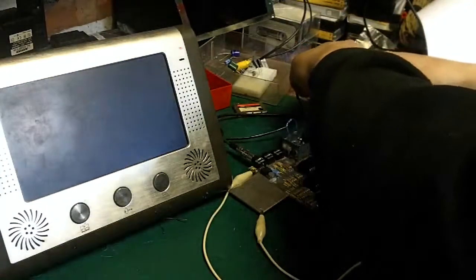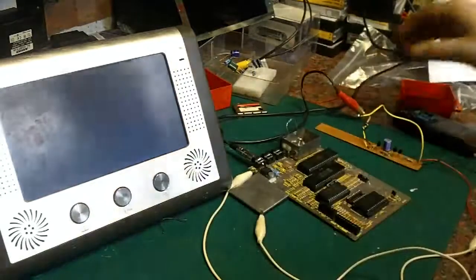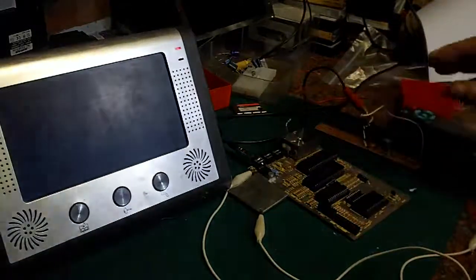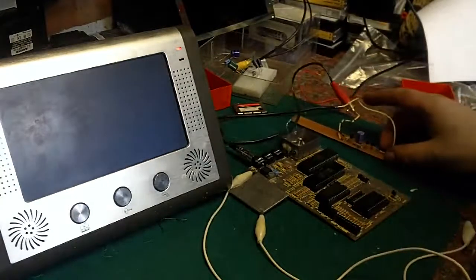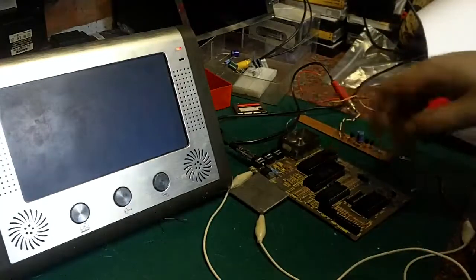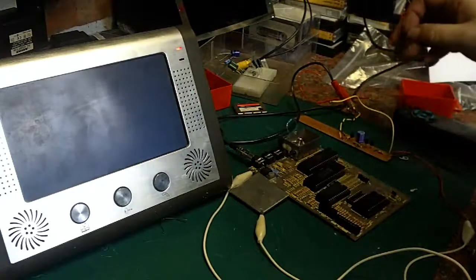and we plug it into the board there, and this wire is our input wire. Now, on the original design it said to put it to pin 16 of the ULA. If you actually do put this on pin 16 of the ULA, I wouldn't recommend that because you've far too much chance of shorting 2 pins together and potentially damaging your ULA.